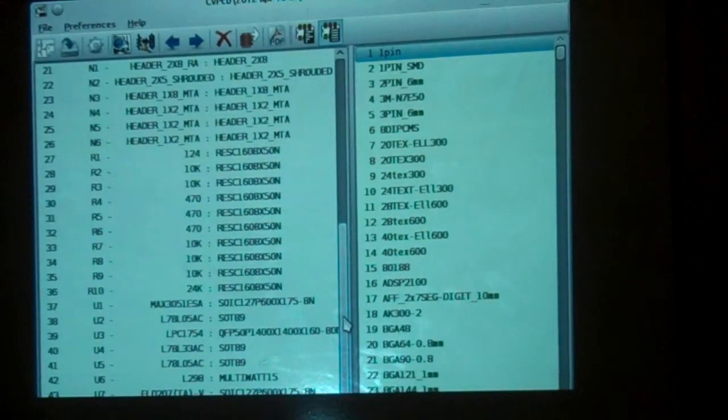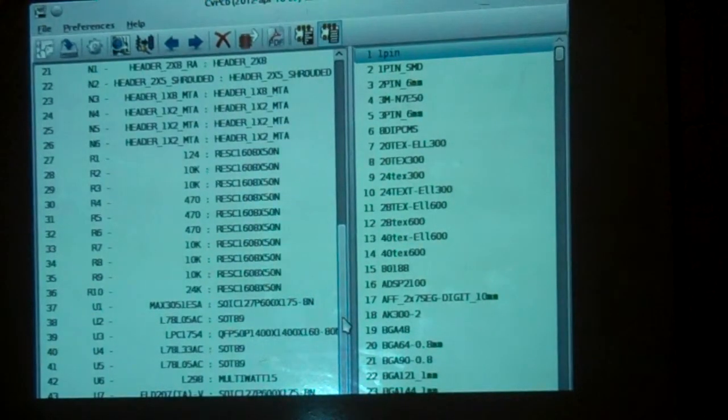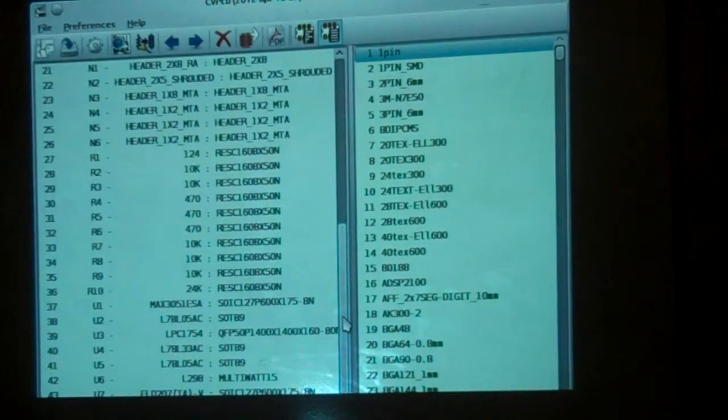Okay. Labels on the bags, or the parts come with labels. If it's paper tape stuff, I will frequently turn it over and take a Sharpie out and label the back of it, because the moment the piece of tape gets separated from its label, you no longer know what it is. You may be able to somehow get two probe leads on the part to re-identify it, but usually what I do is I just throw the piece of tape away because I blew it. Okay, so managing surface mount parts is a pain in the tush.